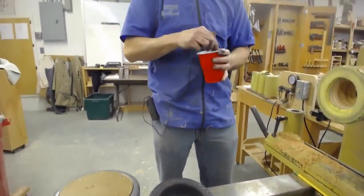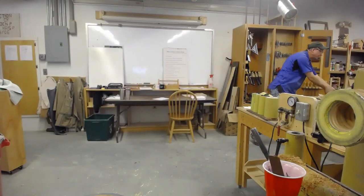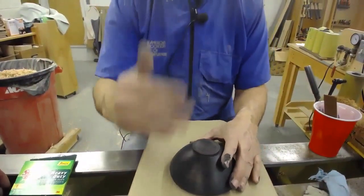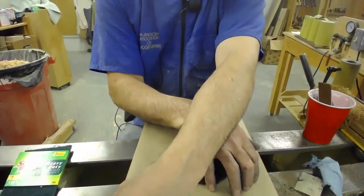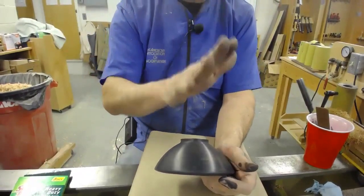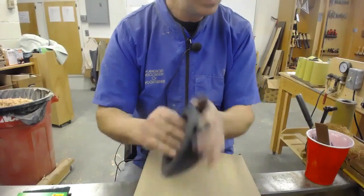For blue, the paint has to be mixed closer to the recommended 50-50 ratio, because you need it to stick and not drip too much — thick enough to cover in one coat. What I found when I did two coats was that even from the same batch the second coat is a slightly different color, and you'll see that when you sand through it. There was an article in American Association of Woodturners magazine about a guy who does big vessels, textures them with carving, and paints four or five different colors — then uses the same sanding technique and sands through different layers to reveal blue, then red, then green. I haven't gone with more than just black and then a final color yet, but this one is ready for the blue.